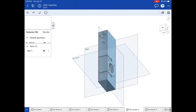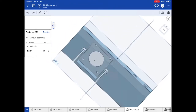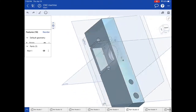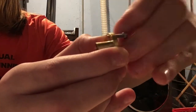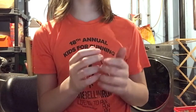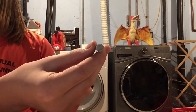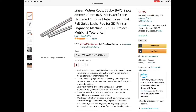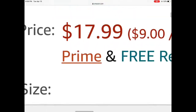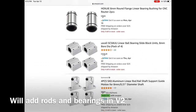Now for the next big 3D printed part. This is going to be the part that moves linearly down the Y-axis and contains the stepper motor, bearing, and guiding rod for the X-axis. This 3D print took about eight and a half hours — and there's a 12-hour print coming up soon. Use M3 bolts to secure the brass nut to the part; depending on how well the print went, you might press it in by hand or need a vise. Thread it onto the lead screw, then add one of the guiding rods. These are 5/16-inch metal rods. I would recommend buying rods specifically for CNC machines and 3D printers because they come in sizes you can buy linear bearings for. I'd really recommend linear bearings in this project — I'm not using them because they're more expensive and hard to get in a reasonable amount of time, but don't be like me: buy nice rods and linear bearings.